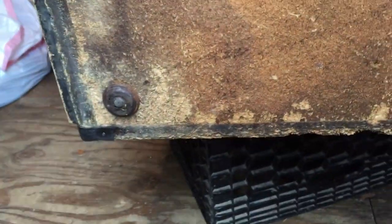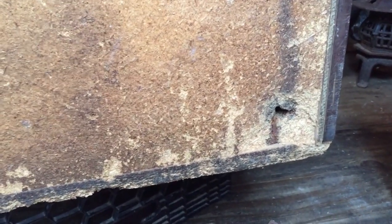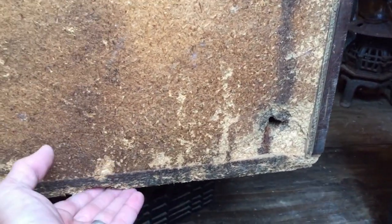We're going to... I put all my stuff on casters. Even with the little stuff, it seems to serve me well, moving things around the basement, and especially moving things around when I'm working on them. But we are going to repair that with Bondo glass. I've had good luck with that, even screwing leg levelers into that or wheels into it later on. It seems to do a pretty good job. It seems to hold up. It doesn't just chip out and flake out like Bondo would.